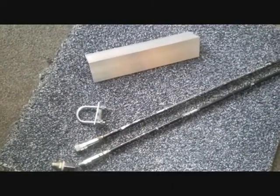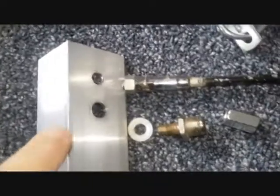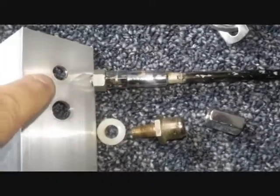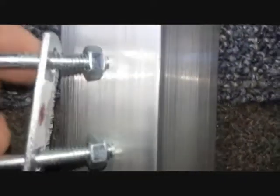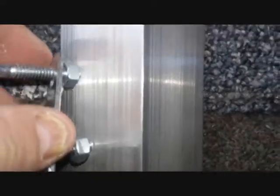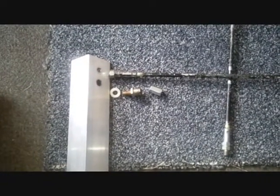Let me get some holes drilled and I'll report back to show you the 2-meter half-wave dipole. I have the half-inch hole for the mount and a little over 3/8 inch for the ground side, which is going to go down — the mount is going to come up. I just need to mark, measure, and drill one through the bracket. I'm also going to put a quarter-inch hole on this side so you could use this on a tripod — this is going to be a portable dipole, that's my intention.